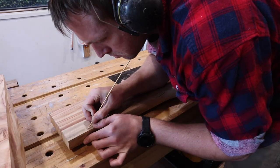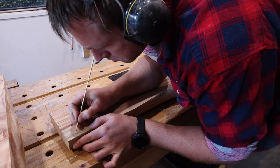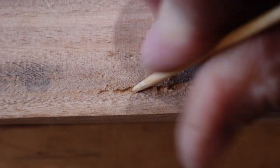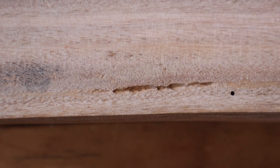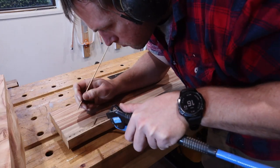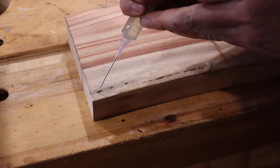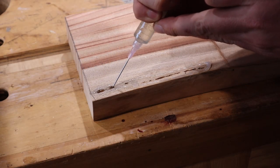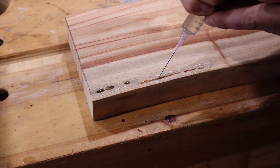The next step is a bit more slab prep. I use bamboo skewers to try to clear out all of these little bug tunnels. Some other YouTubers will use dental picks and similar specialist tools, but I only have these bamboo skewers — I tend to do more barbecuing than dentistry. These bug tunnels are pretty common in air-dried slabs, and the soft stuff they leave behind won't be stable or take finish, so we've got to get it out.